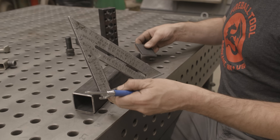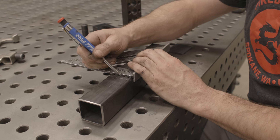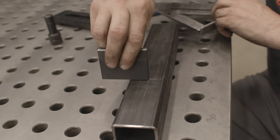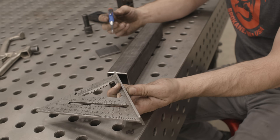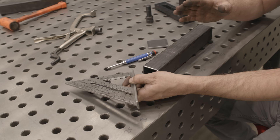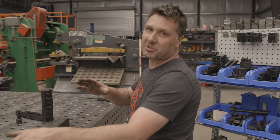Now I know you're going to say: Jason, I would just lay out where it's going to go, make a mark on here just like this, scribe out where it's supposed to go, give myself an end stop, put my tab on here, drop my hood down and tack it. I understand you can do hundreds of them with just a simple speed square and a layout marker, but I want to go brain dead — I don't want any measurement errors. Setting up a fixture is the right way to do this, but I fully understand your concerns. A fixture table is just that much better.